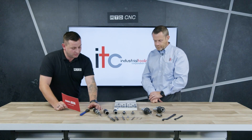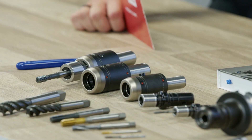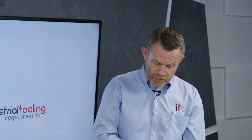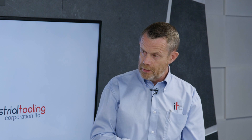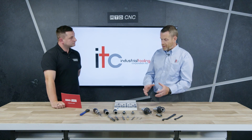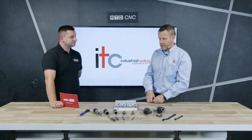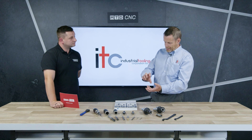Can we talk about the synchro tapping heads now? What would be the advantage of using one of these over a normal collet system? The biggest issue when tapping, even on a rigid tapping cycle on a CNC machine, is the synchronization between the spindle rotating forward, stopping, and then retracting in reverse within the same pitch. A lot of machines claim accuracy in their rigid tapping cycles, but there's always going to be an inconsistency — especially when using imperial size taps on a metric control — because there's always a rounding involved.